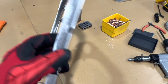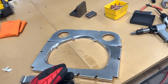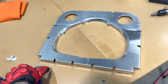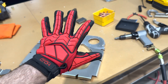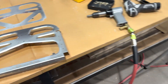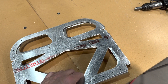Got this one done — everything's riveted in place. By the way, these gloves — a buddy of mine, Joe, he's a helicopter pilot and mechanic who used to work for McDonnell Douglas and then Boeing, and he's gone on to work for a space company. He told me recently: if you're going to do a lot of riveting, get yourself a pair of impact gloves. I've got to say I love them — it works great. If I'm holding the bucking bar it really takes the shock out, so I call them my Spider-Man gloves. Thanks Joe. Next up is station nine — gets this doubler riveted to the bulkhead on the flat side. I've got the station nine bulkhead and the doubler; I'm going to hit this with some sandpaper, break the edges a little bit so it's not so sharp, and then get it Clecoed and riveted.